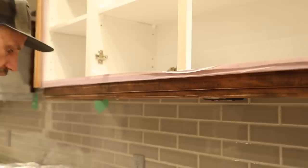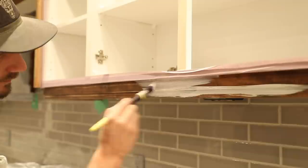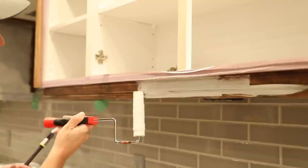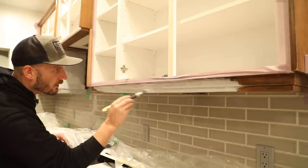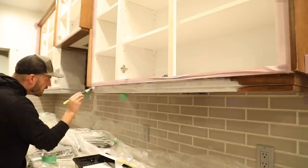At this point I'm just taking this little brush and ramming the paint into the cracks along here and along the top, then coming across with the roller to smooth it out. At this point I'm more skeptical than ever by seeing how the paint is going on — it doesn't seem to be sticking very well, but I guess only time will tell. And of course this is just the primer — this Stix primer is supposed to be the bee's knees according to the Benjamin Moore lady.